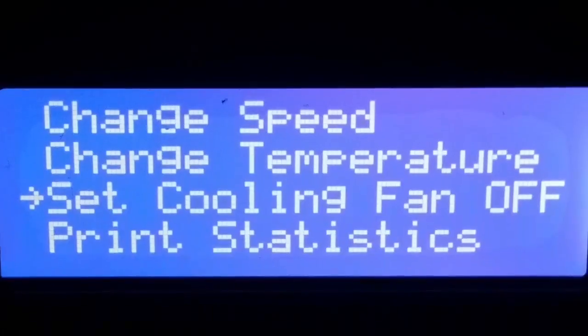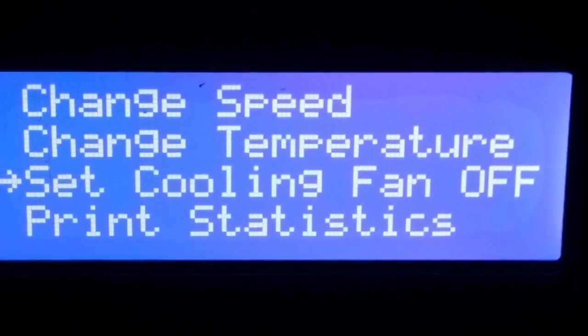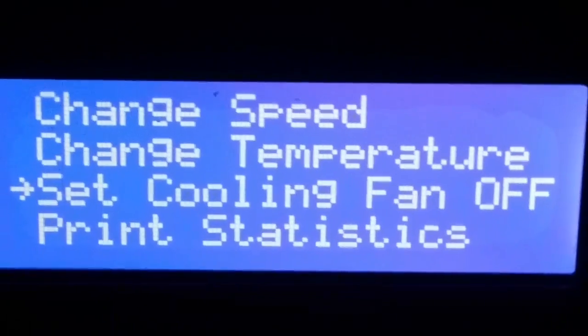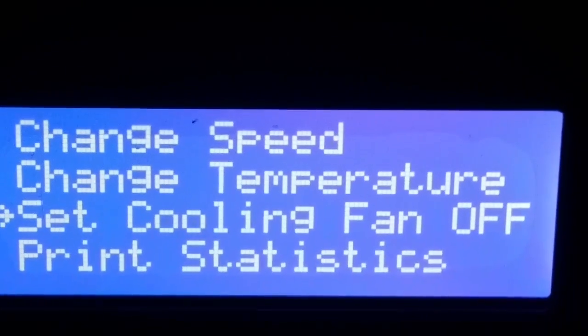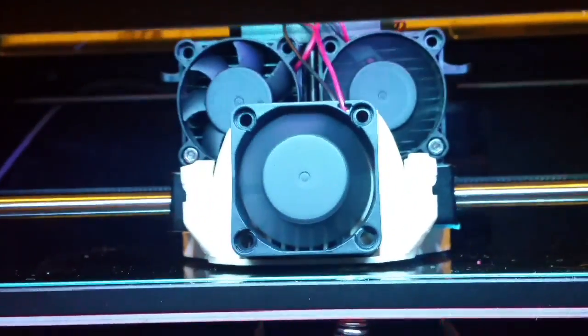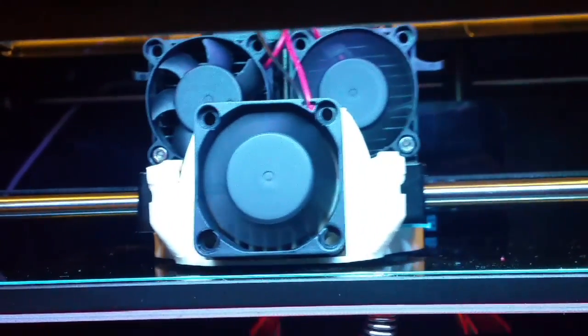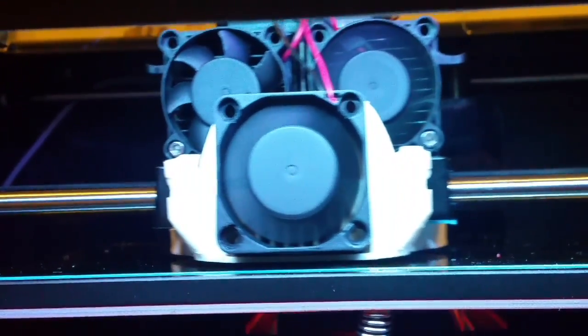So that's good. You can change this in the program — I'll have to do a full print job because it's set to start on like layer two. I've started a fresh print job with the new program activating the fan control. It's just finished its first layer and bang — on comes the fan.